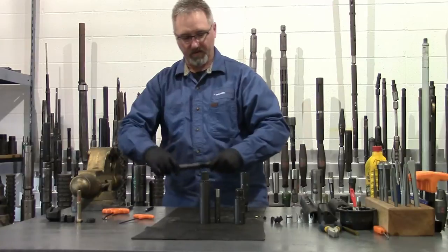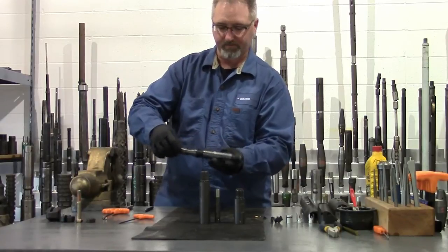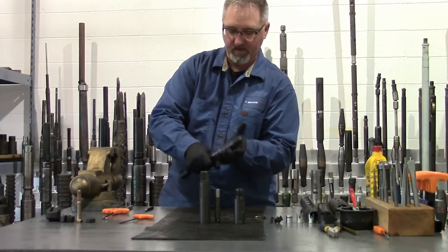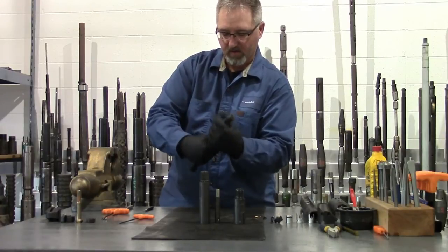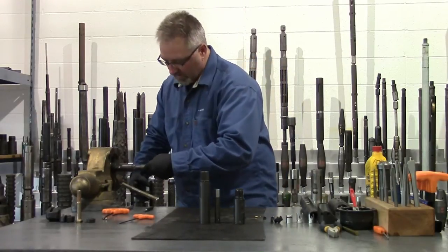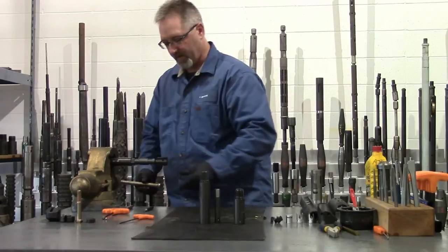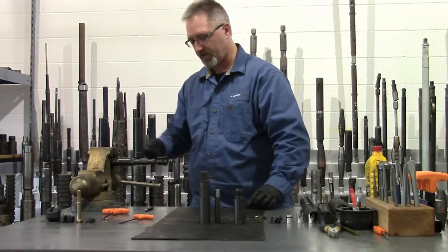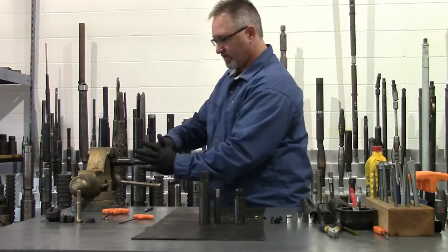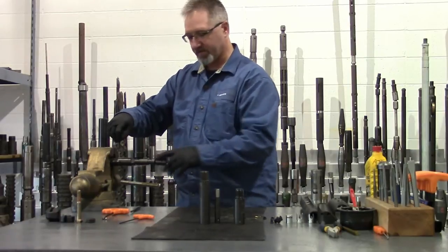The easiest way to set this up is to install your piston and everything into your sub and thread it in, using the threads to push your O-rings into the sub. Once they're in the sub, you can clamp this in the vise, leaving the shear pin holes exposed. Take a quarter-inch pin punch and lay it in beside the fish neck at the striker pin fish neck, press the pin to line your rings. That perfectly aligns your shear pin holes with your piston groove.